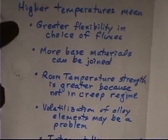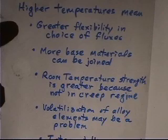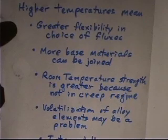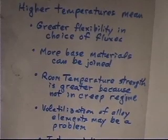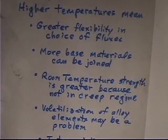In fact, virtually any metal or ceramic can be brazed. I don't know of any metal that can't be brazed. And if you look in the brazing handbook, you can braze aluminum oxide. In this case, you're not trying to get rid of the oxide. What you do is you have a reactive metal. And one of the popular ones right now is a silver, copper, titanium, where the titanium is 2 to 5%.